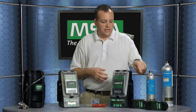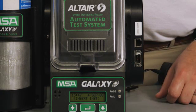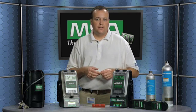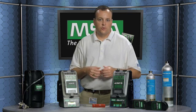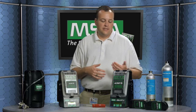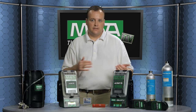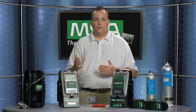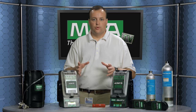With this Galaxy system we have a lot of great accessories as well. There is a network connector accessory that has a serial port connector allowing you to hook up a printer and get an immediate print receipt for your calibration or bump. It also has an ethernet connector which will allow you to do a wired network connection to a PC. There are a lot of different ways through the accessories to get the record of a calibration or bump — pass or fail — with a time and date stamp recorded, as proof that an instrument was calibrated or bumped at a certain date and time.